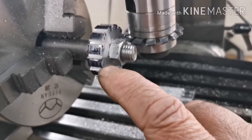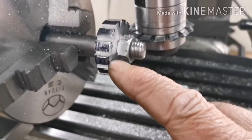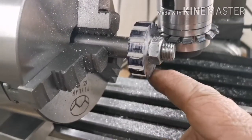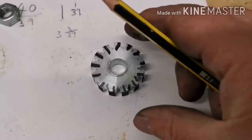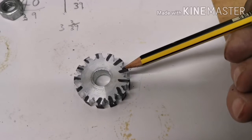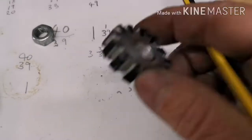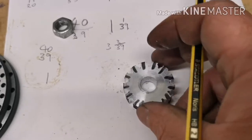I've been around once — I know I'm not at the full depth, but I think I'm going to have to do a bit more research, because they reckon that's supposed to be a 13-tooth gear but I reckon it should be more than that. That is definitely 13 teeth around that disc — one, two, three, four, five, six, seven, eight, nine, ten, eleven, twelve, thirteen. So I've got that part right, but it's not right — I'm probably going to have to buy some different cutters. It was nearly there, worth a try.